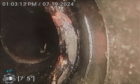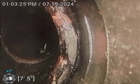Right here is the transition from the ABS pipe, the new piping that was installed, to the cast. You can see that there's a big lip right there, and it's only about 8 feet in the distance, but this appears to be where the issue is. It's catching all the debris and the paper and the other items that are being flushed down the toilet, getting caught right there and causing the blockage.